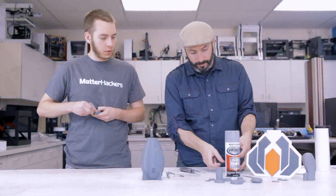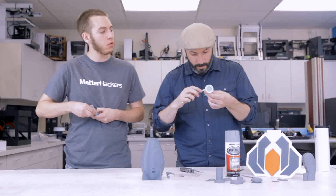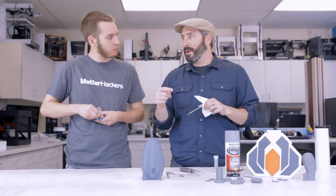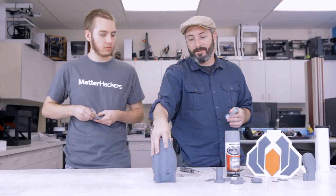When I was first getting started with 3D printing, I was trying to find what settings people use for printing props — everybody has a different answer. Some people print really fast with thick layers, others print slow with really fine layers. What works best for me depends on the application. Usually I set up a print at night and tweak the layer height until the print will be done right when I wake up. Because I know I'm going to do this finishing work later, I'll often just say I'll sand it later rather than spend time tinkering with the print settings to get it just right.